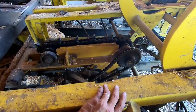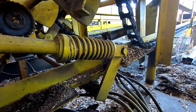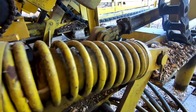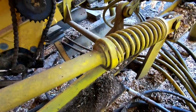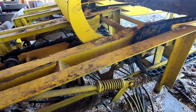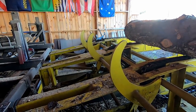I do get comments about these loader arms - people want to know why I can't control them individually. These loader arms are controlled off of one arm, which is controlled off that hydraulic cylinder right there. When it pushes, all three come up, and every one of them has a big heavy-duty spring. That spring takes up all the difference in the sizes of logs - if a log's fat on one end, they take up all the shock so you're not pushing hard with hydraulics. It's actually that spring you're pushing with.